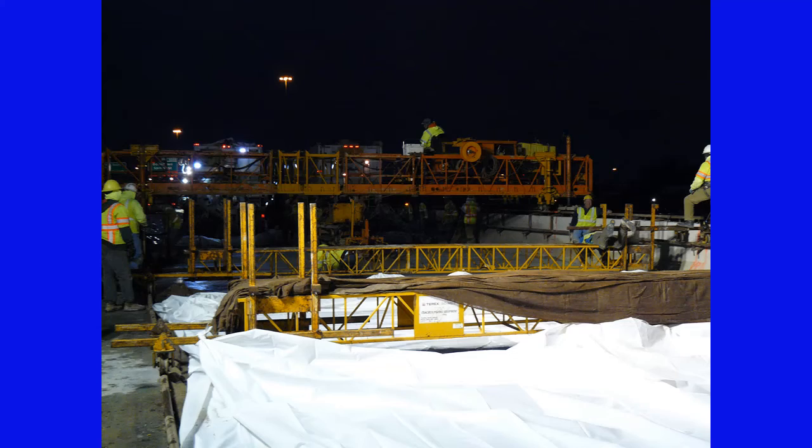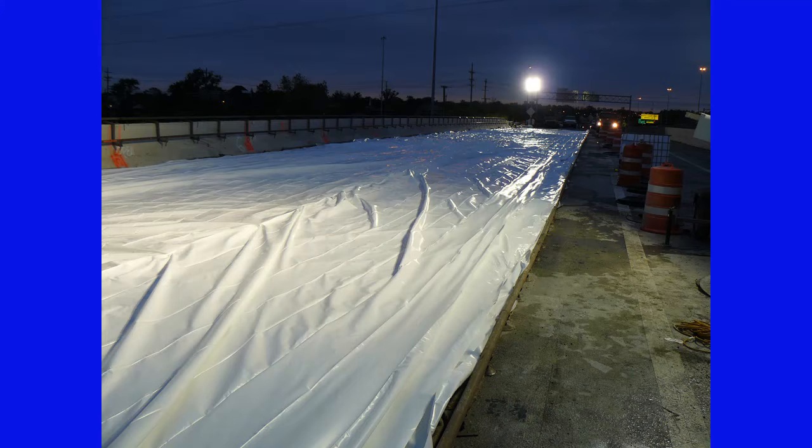It is also important to understand that beyond the pour, the temperature ranges need to be maintained during the curing period as well, and the installer needs to cover and, if necessary, heat, cool, or insulate the deck and LMC for the first 48 hours following placement. The temperature of the LMC will increase beginning at about 6 hours after placement because of the cement reactions, and the temperature will return to that of the protected overlay deck environment within the first 24 hours.